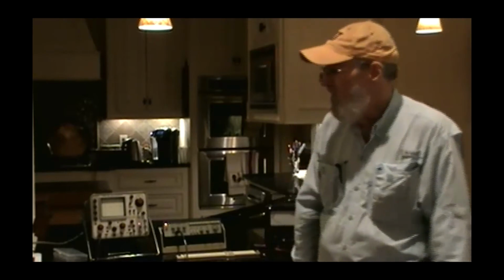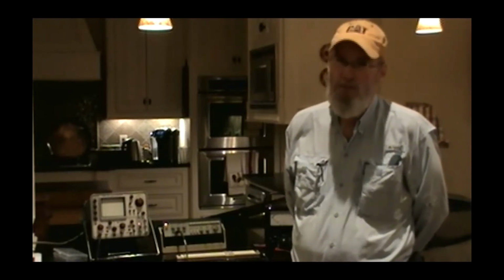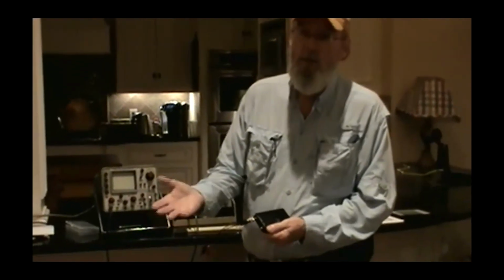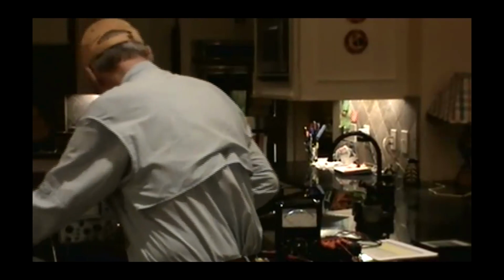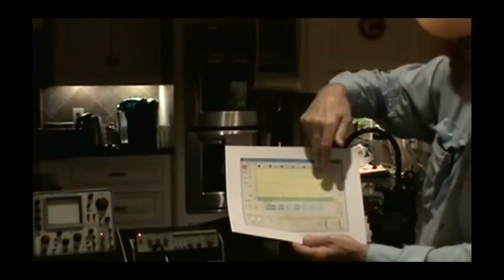Extremely useful devices. There are a good number of antenna analyzers out there that do similar things with just one port, but you don't have the ability with them to do transmission tests. By transmission, that basically is coming out one port, going through a device, whether it's a filter, a radio, a duplexer, whatever you want to see the bandwidth of and the tuning of, and back into the other side. You would actually get a rectilinear display, something like this, where you've got loss, shunt, or transmission, depending on how you look at it. But for checking filters, for designing anything that's a band pass or a high pass or low pass circuit, for tuning duplexers, that's extremely useful. And the single port antenna analyzer does not give you that.